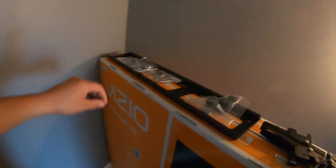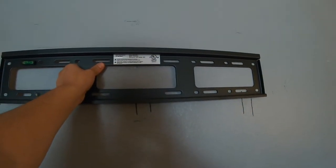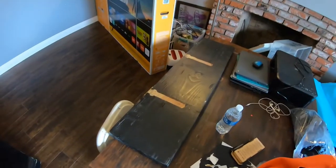I was just going to mount it right here, but when I was looking for the studs I noticed the studs weren't evenly spaced out. That raised a red flag for me because I don't know what might be behind it — what if it's a cable or something. I don't want to accidentally cut something that's not supposed to be there. So what I'm going to do is cut this open and install this 2x12 that I had laying around, and then mount that to the TV mount.